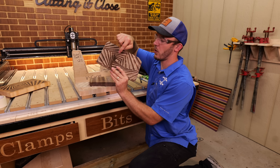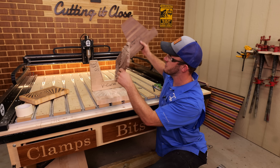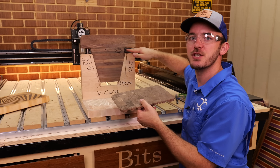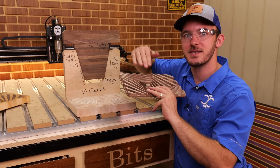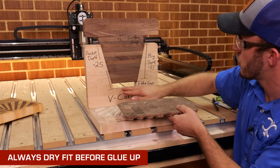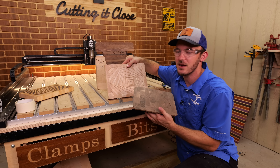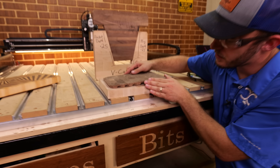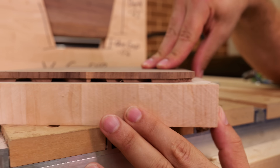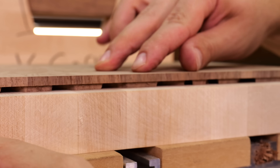When cleaning out the male, there will be some fuzzies at the bottom. Don't worry about them — when you flip it over and fit it in, you'll have a tenth of an inch of surface gap. As long as there aren't fuzzies sticking up more than roughly a 32nd of an inch, you're good. This is the dry fit — you'll have about a 0.02 inch glue gap on the bottom. If the fit looks good, you're ready for the glue-up.